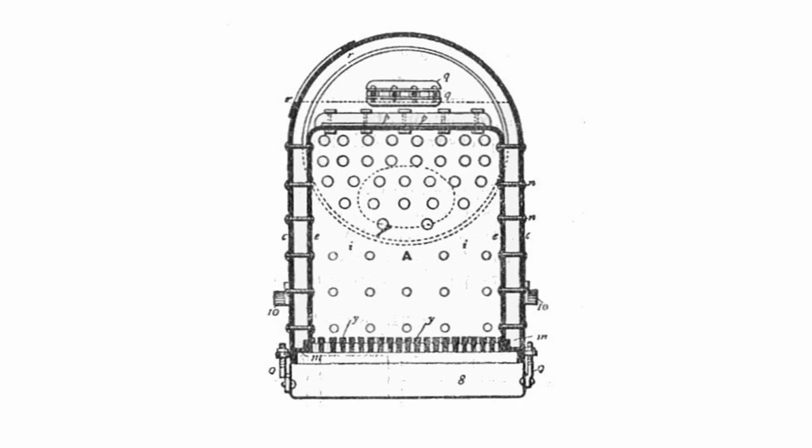The upper crown sheet of the inner firebox, as with most locomotive boilers, is approximately flat and horizontal, so as to maintain a constant depth of water over this hottest part of the firebox. This flat surface, with steam pressure on its upper side, requires stays to support it. As it is not a constant distance from the boiler barrel, unlike the firebox sides, this staying is difficult to arrange. Early examples soon used girder stays to support the inner firebox crown.